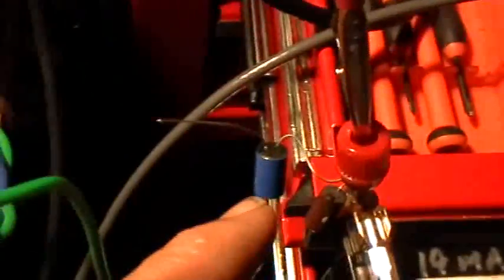This one's a bigger one and it's blue, and this one's a smaller one and it's brown. And what I'm going to do is show the effect of those inductors on the waveform that you get. Those aren't very big inductors, but they do correspond to some wire length. Okay, so there's your oscillatory waveform without the inductor, without any extra added inductance.